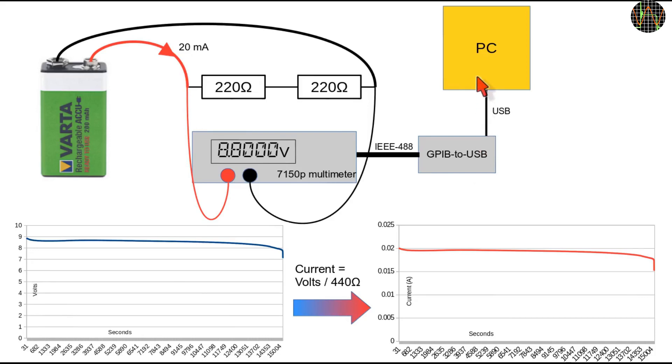The slight problem of this approach is that there is no auto shut-off, so after 10 to 12 hours when the voltage drops to 7V, you need to be at hand and disconnect the battery to avoid damaging it. With all this we get a nice voltage over time graph. To turn this into capacity: it is easy to get from voltage over time to current over time since we use a constant 440 ohm resistor for discharge. Now that we have a current graph, capacity is the area under the curve — in other words we need to integrate. For such a simple curve this can be done easily with more than enough accuracy by using the average function in a spreadsheet. If you have a list of voltages, you can do the average on the voltage first and do the conversion to average current without having to calculate the current for each sample.